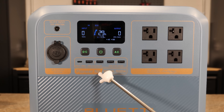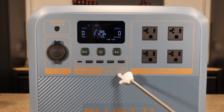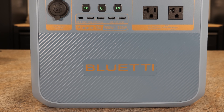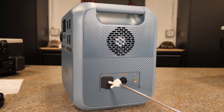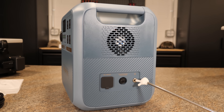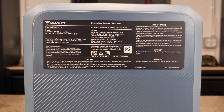We get one USB-C at 100 watts and four USB-A ports at 5 volts, 3 amps. The AC outlets are 120 volt, 20 amp outlets, up to 1500 watts with a pure sine wave inverter. The front panel says Pioneer NA — battery size is 900 watt hours and the inverter is 1500 watts. On the right side is the fan exhaust, AC input, circuit breaker, and a ground screw attachment point. On the back sticker: model is Pioneer NA, household input is 120 volts up to 15 amps max, DC/PV input is 12 to 60 volts, 10 amps, 500 watts max.